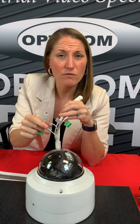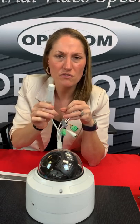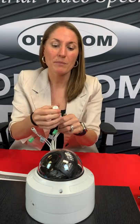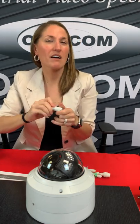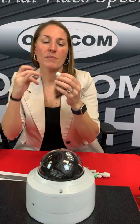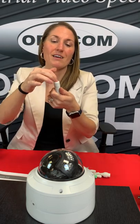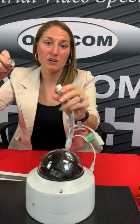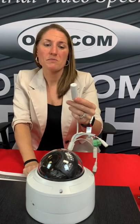Here you've got the power connection — 12-volt DC. This is still PoE, but it has a local power option on it. This is our waterproof RJ45 connection for the PoE and for the video — power over ethernet and video. Here's the RJ45 connection right here. You would build your cable — Cat5e or Cat6 or whatever you're using — and go through here. There's a rubber grommet that helps with that waterproof connection. It comes out on this end, you put your RJ45 connector, and when you seal it up it tightens that rubber around the cable so it stays snug and water can't get in. Then your RJ45 plugs right in here, there's another grommet for sealing to secure that, and you've got a nice tight seal. We always recommend that you silicone as well, because it really helps with the waterproofing.